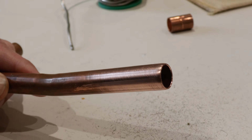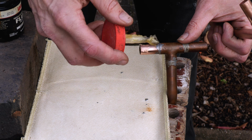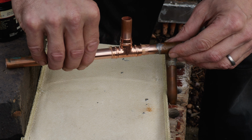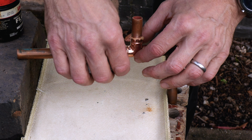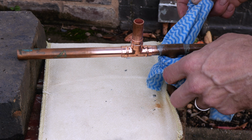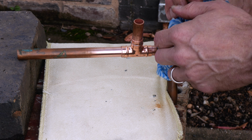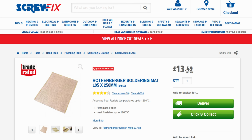Quick clean of the pipe with some wire wool. And there's some flux on the part of the pipe that's going to be pushed into the joint. Then a wise man once told me to wipe off the flux residue. And then a wet kitchen cloth wrapped around that old messy joint the previous plumbers did to stop the solder melting when I solder the new joint. Oh, and this is a soldering mat to protect what's beneath it. I'll put a link in the description.